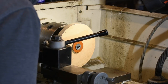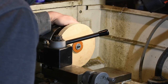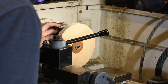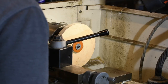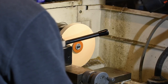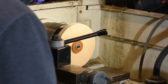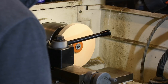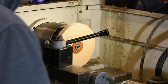The way the mandrel works: I leave the face of the mandrel a hair shy of the face of the wheel, then using some scrap Micarta, a small washer, and a 1/4-20 cap screw, I snug it onto the chuck. If I were cutting metal this would be a terrible approach since the wheel isn't dogged to the chuck and will slip easily. But by taking very light cuts at a fairly high rotational speed with a slow feed, I don't run into any problems. Is this good lathe hygiene? Nah, but it works.